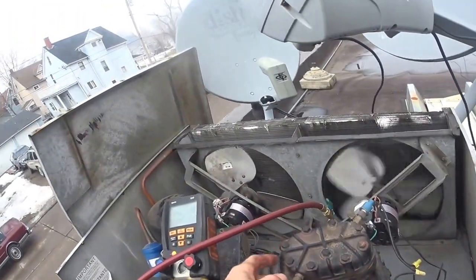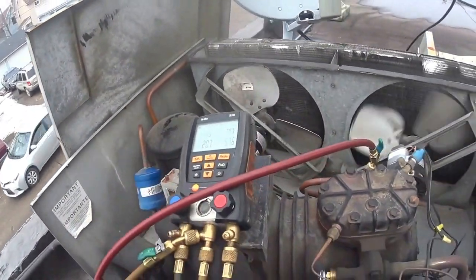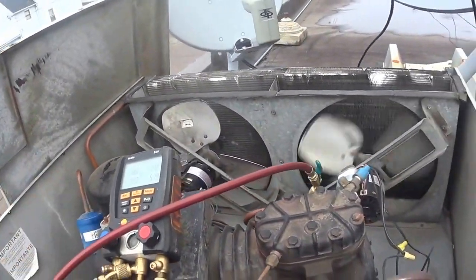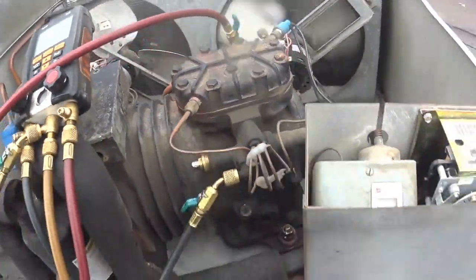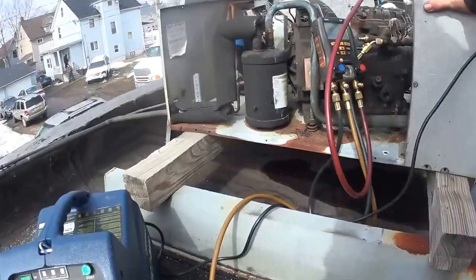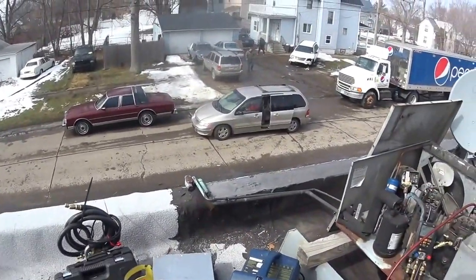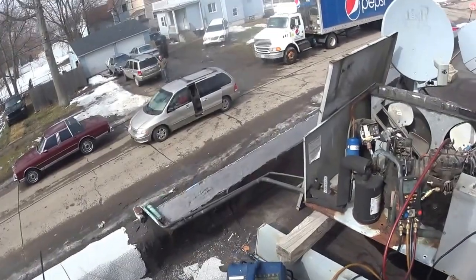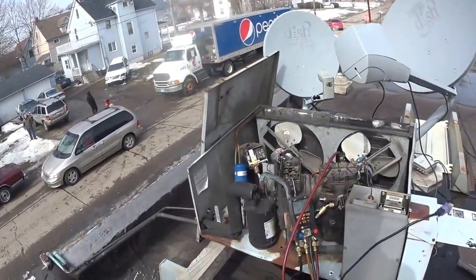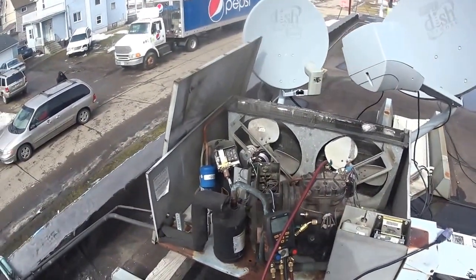I have to pipe it in. Bolt it down. See, it only pumped down to 20 pounds pressure. Not enough. Okay, now I gotta reclaim the refrigerant and have some fun. I put some oil on the bolts so it'll come off easy. I'm reclaiming the refrigerant MP39 right now into the tank. And I'm down to 12 pounds, 11 pounds pressure, 7.9. It'll be a little while yet.